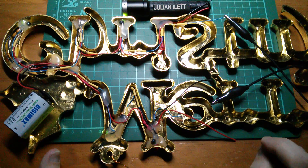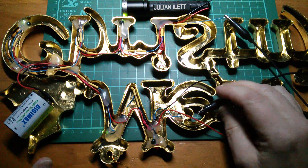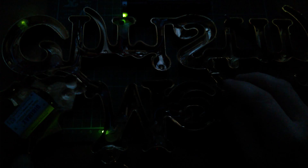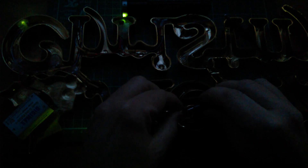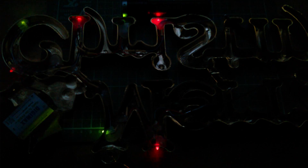It's all getting a bit tight for time now. I've got seven stages, so I can connect the output of the seventh to the input of the first. Let's turn the lights off so we can see the LEDs. The green ones are now coming on in the unconnected state. Let's connect it up — and we're starting to get a sort of sense that there's movement around the ring of LEDs.